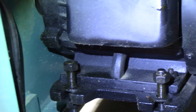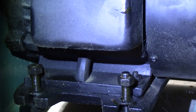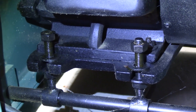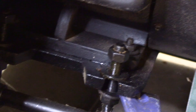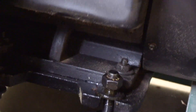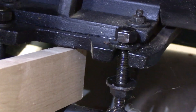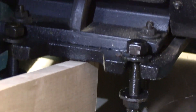You can see the two bolts that I've loosened — now the motor is free to come up. I've got a pry bar in here just to show how the motor can be moved. The motor is very heavy, but it can be moved up, which takes the tension off the pulley. I've now brought the motor up and put a block of wood there to hold it, which is going to really loosen the pulley.